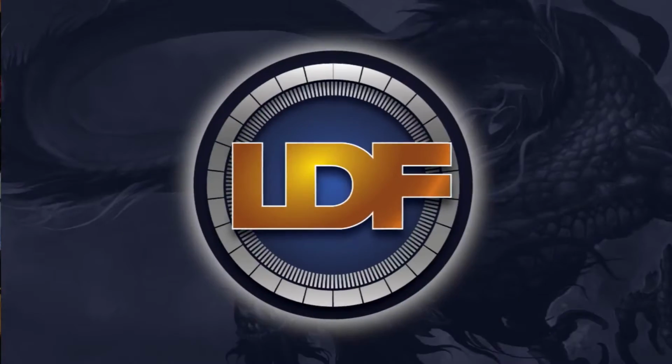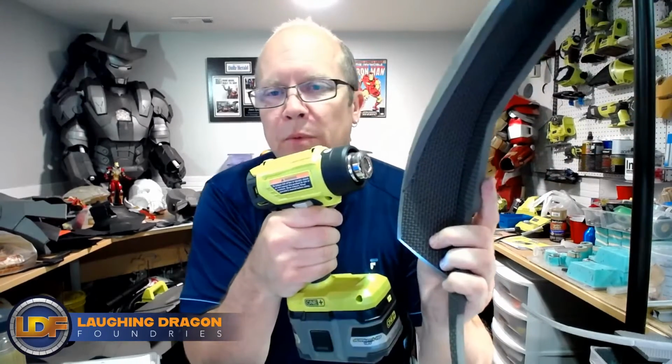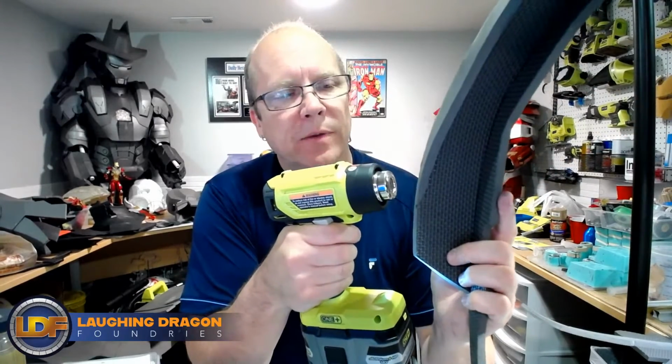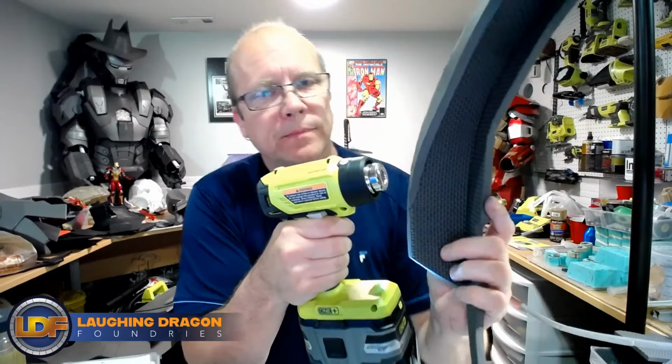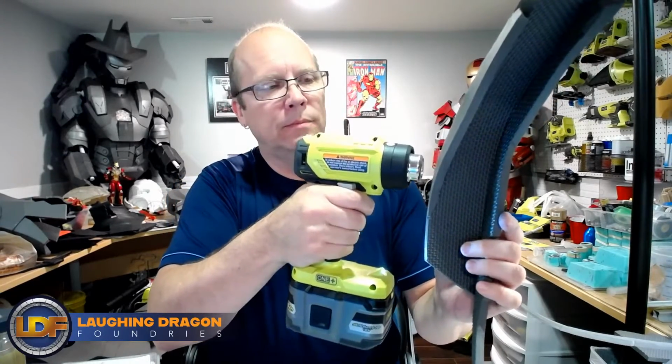So, remember when I told you before, when you're working with contact cement, to always do your heat tasks first. And the reason is because heat applied to a contact glue seam will actually loosen it. So now this is going to work to our advantage. So we're just going to hit this with a little heat.